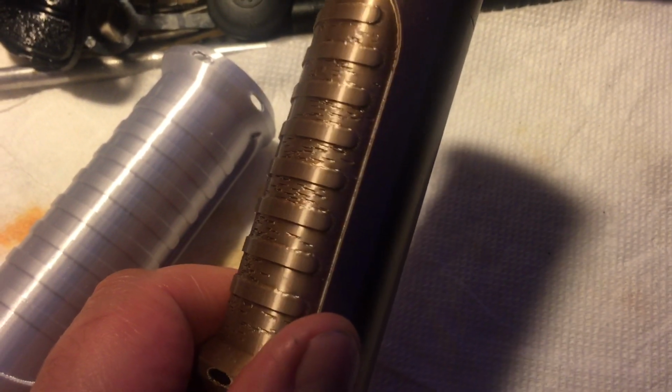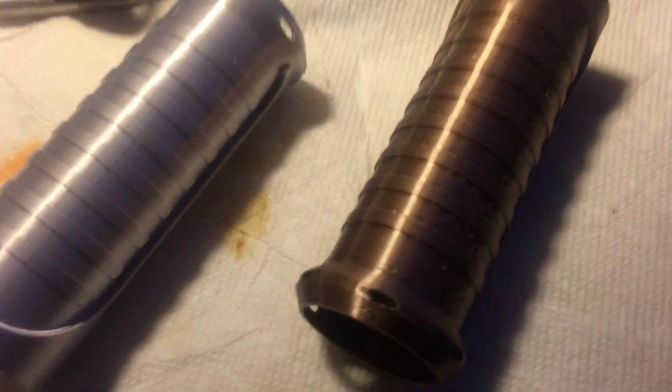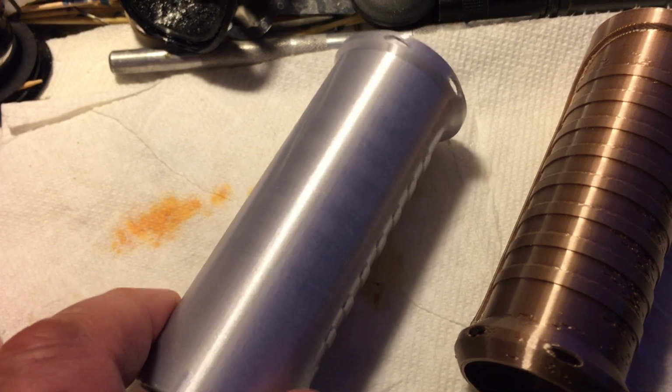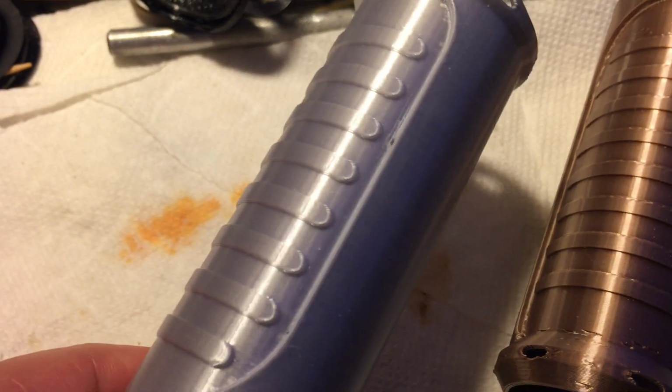Almost always, when you see under extrusion like this, where you didn't have it before, it's almost always your hot end. So, pardon me here. Had to clean my camera lens. So this is what the print looked like after I finally worked on my printer to solve this issue. This nasty looking 3D print. Look at this. It's freaking perfect.